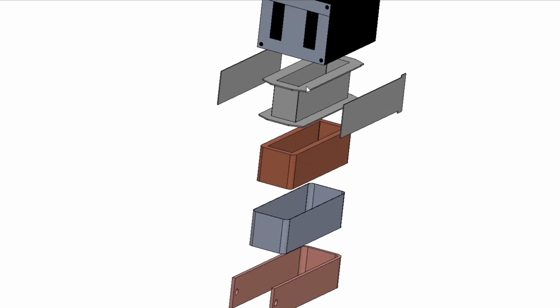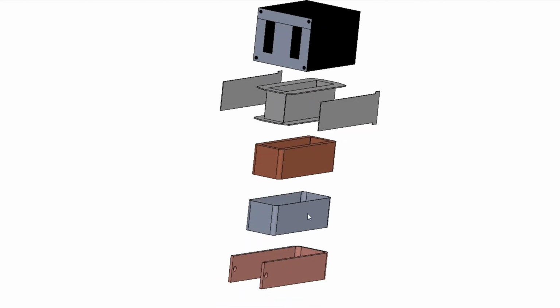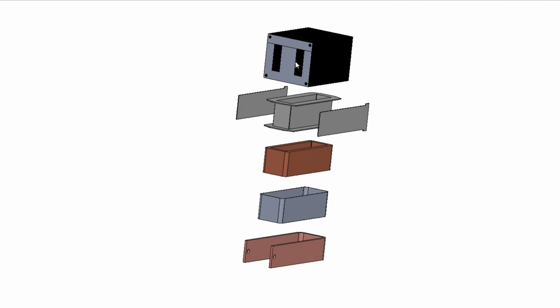But here we go. So the primary winding is round the bobbin as tight as possible to reduce any wastage of this window winding area. The primary winding then also has a protective tape around it. It also acts as a barrier between the primary and the secondary winding. It is a special tape that is used for transformers, like a paper tape. It is sticky on one side and papery on the other side. Papery plastic, sort of. So this bobbin goes on, slides onto the core.